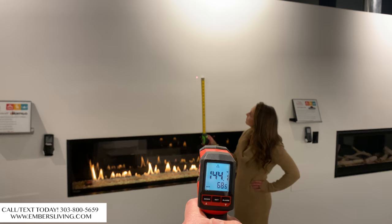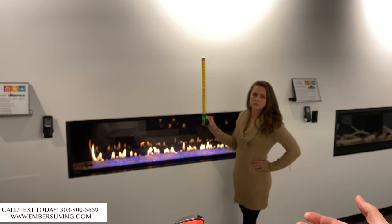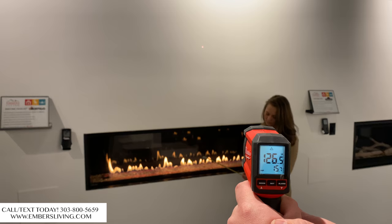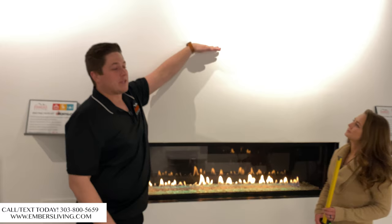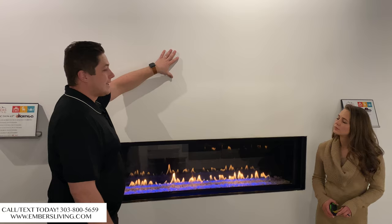Now give me 18 inches — we're at 142 degrees. Televisions say they don't want to operate at higher than 104 degrees; that's the room temperature, not the wall temperature, so it's sort of hard to decipher. But we're getting into a more acceptable range at 142. Realistically we probably want to be in the 120s. At two feet, we could install a TV here, but the bottom would be quite high — doable if you have vaulted ceilings, but that's option one.